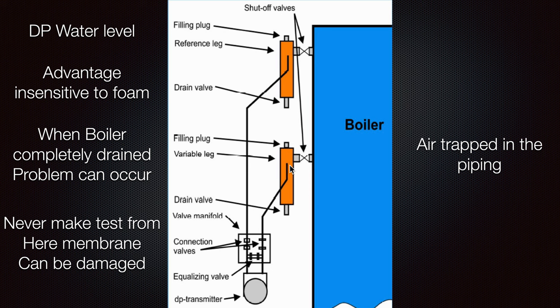All that necessary filling up and recommissioning back again — until the air is expelled. We have seen examples where we needed to do it five or six times. Also, when the boiler heats up again you can get the same issue. It is good practice to test your boiler as it fills up, monitor it, and see how the level reacts. Compare the actual level from the level gauges with what you receive in the control room.